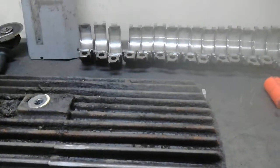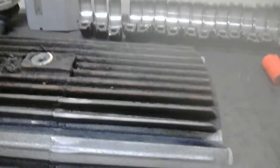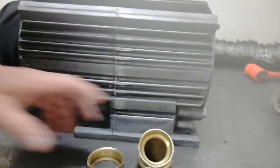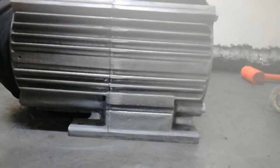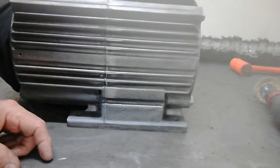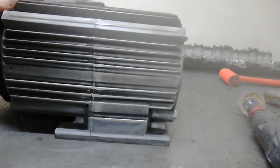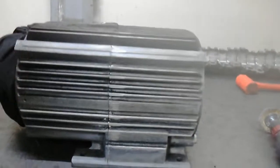Remove all these heavier pieces and then come in with a small wire brush, and then come in with the electric motor-driven wire wheels and just clean up the face here. Getting everything cleaned up, moving all the gunk off there - using a bit of solvent in a spray bottle and just spraying the heavier sections to get it out of the little corners, then coming in with different diameters and different shape wire wheels to clean all these out. That probably represents about 20 to 30 minutes of work, I didn't really watch the clock but roughly about that.